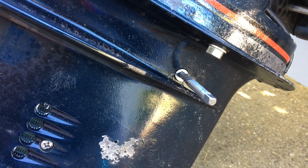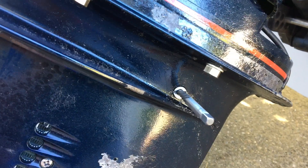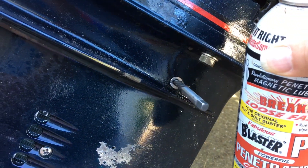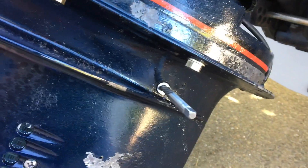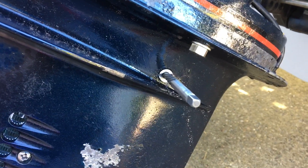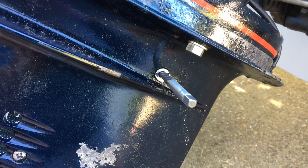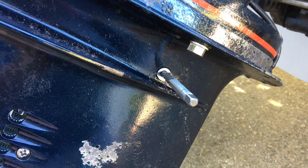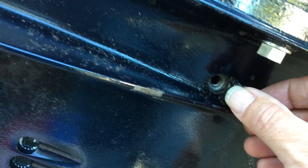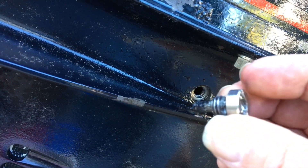When drilling, make sure you have a good bit that's able to work with stainless steel, such as a titanium bit. One of the main things is to drill slow and use a coolant — I've been using Blaster, just spraying it in the hole occasionally. Don't go too fast and just apply steady pressure. When the hole is deep enough, go ahead and try to get the extractor in. The screw came out pretty easily with that extractor without much pressure.